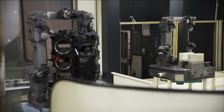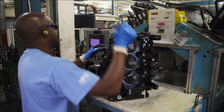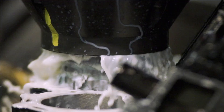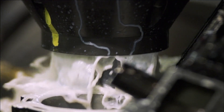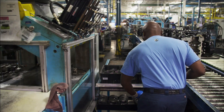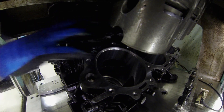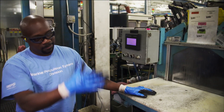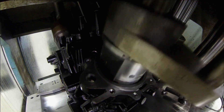The build for the power head starts with a cylinder block. The cylinders are machined under cutting fluid to precise dimensions, then each cylinder gets a liner. We push cast iron cylinder liners — also called sleeves — down into each of those bores. Once you see them click, it locks it down, presses the sleeve in, and you're good to go. It works like a charm.